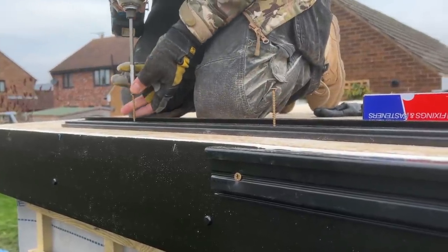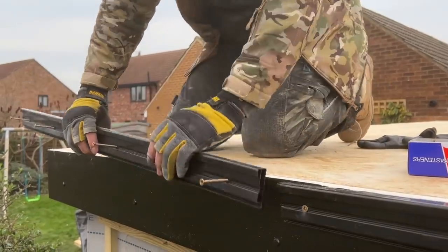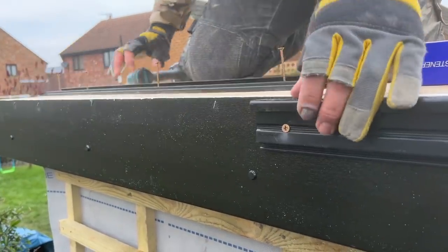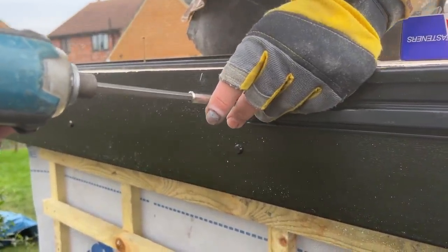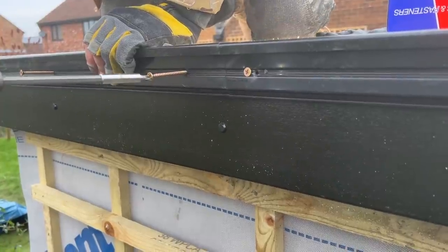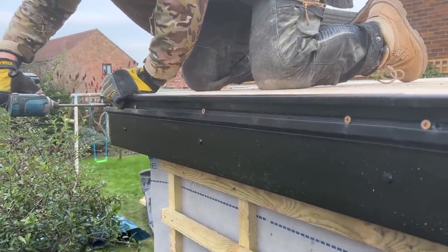I've cut an additional extra piece — not quite 400 because I want to get one near the end as well, staying back about two inches from the end. I'm not actually going through — I normally do this while the rubber's on the roof, but I don't go through just through the first. You can see the line there — that's the screw line — so I'll just send the screw just through that far just to hold it in place. I've failed my own instruction there — I've actually gone too low — so I'm just going to move that screw along and pull it there so it's flush with the top. That's what you want, flush with top.